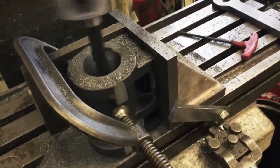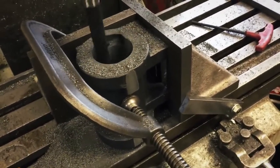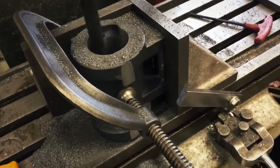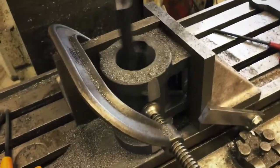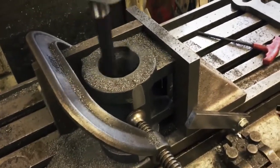Ideally what I would do, I'm still thinking about doing it, is taking it out to the final bore, putting it on a mandrel, and then doing it in the lathe. That way I could face both ends, face the outside diameters, get those where I want them. So that's where I'm at right now, debating that. So, okay, update's coming.